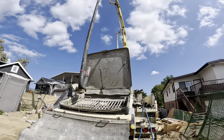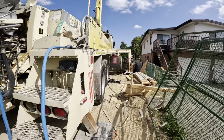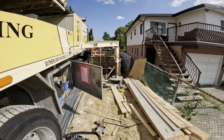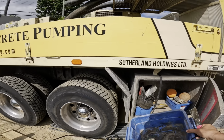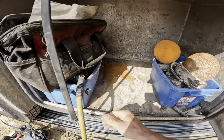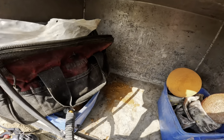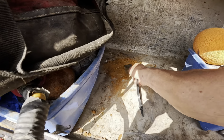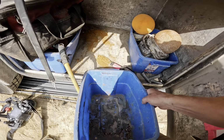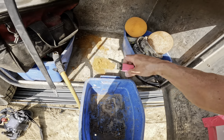Well, this is good. We were just notified that dispatch has gone down. And this ain't my regular ride, and I got no delay powder on here. You can go get some sugar, but I don't want to get sugar. I don't want to kill the concrete. I just want to delay it. So in true fiend fashion here, I got some residue. I'm going to actually scoop this up, and we're going to make some delay set. We'll mix it up in one of these tubs, which actually seems to have holes in the bottom of it. So maybe we'll just throw it in the hopper and mix it up there.